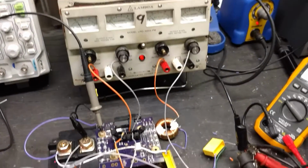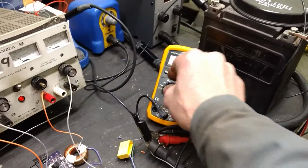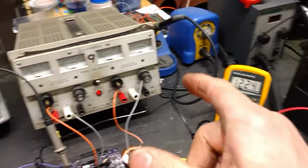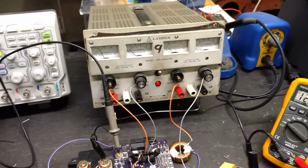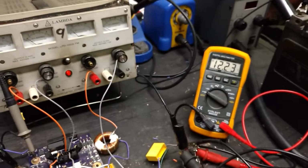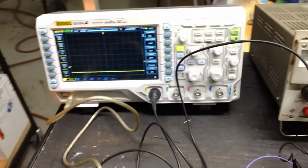This stupid voltmeter, I hate that automatic timeout thing. Nonetheless, one of the goals is to run 110 volts and be able to charge around 230 volts DC output. So charging at 5 volts, I actually just proved in a previous video I could turn that 5 volts into over 60 by running the sweet spot in the duty cycle, which cranked up quite a bit.